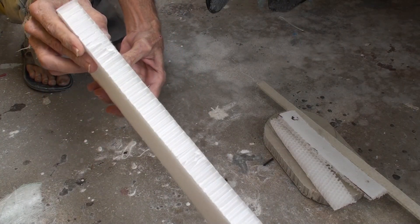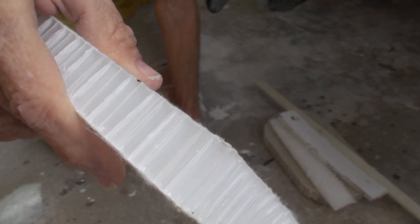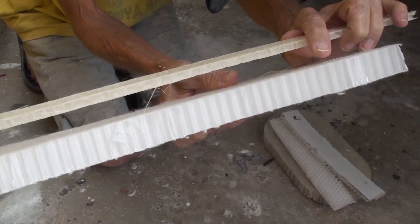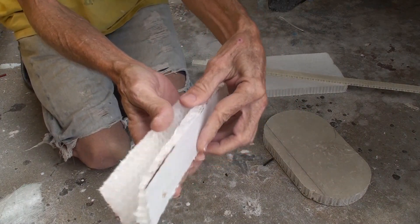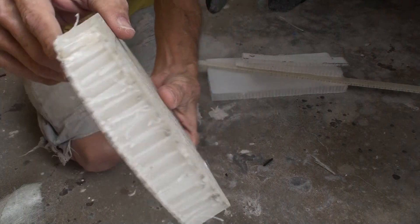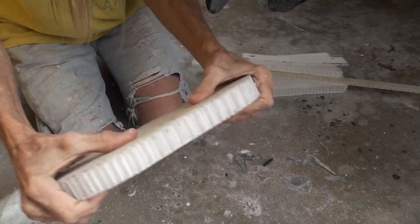Here are the things I made for my boat out of honeycomb core and fiberglass. This is the honeycomb core — you can see the cells in the middle that are like tubes or straws stacked on end. It comes in different thicknesses; the thin one I'm holding is quarter inch, the other is maybe three-quarters or one inch. Cut in half, you can see the honeycomb structure inside. This piece has fiberglass on both sides — just one layer of chopped strand mat on each side.